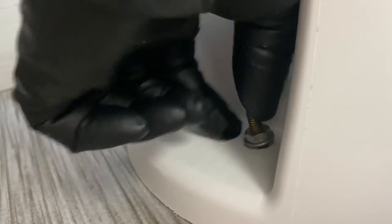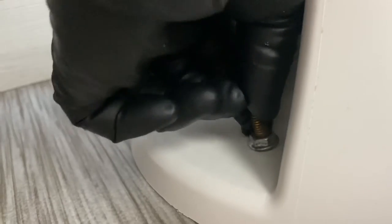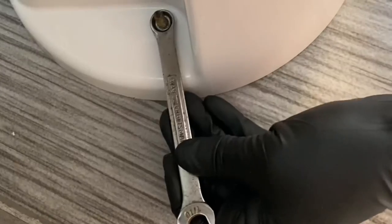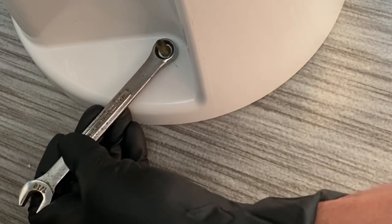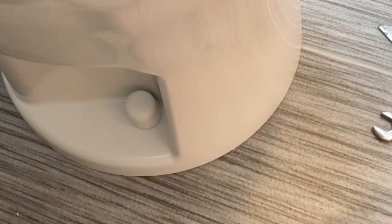Once you've got the commode sitting down and the threads are sticking up through the two holes on the right and left side, take those two little nuts and run them down on the posts as best you can with your fingers. When you get them close, grab that 7/16th end wrench and snug up those bolts. Do not over-tighten these nuts — you could damage the commode. Then simply grab those plastic caps, pop them on top of the posts, and they'll snug into position.